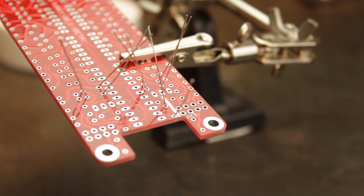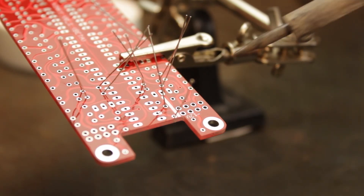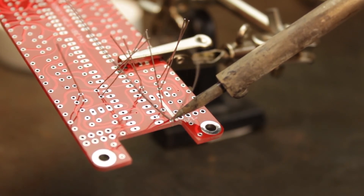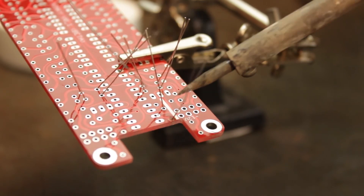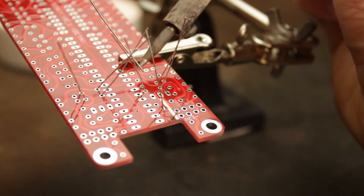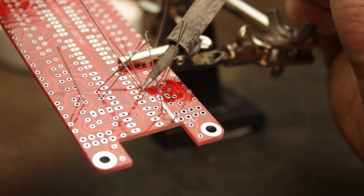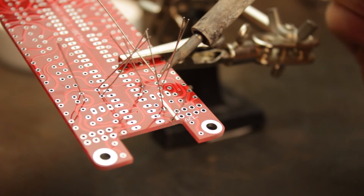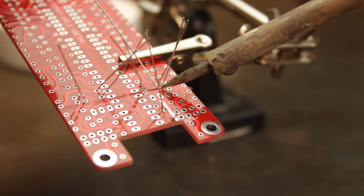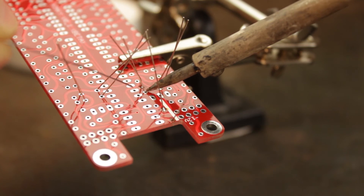In soldering it is important to make sure that we are transferring enough heat to both the metal pad and the leg of the component. First bring in the iron and place it on the surface of the metal solder pad, making sure it is touching the leg of the component. Bring the iron in at a steep angle relative to the board. Now that the iron is in place, do not move it until the job is finished. Next bring in the solder and push it at the point where the leg meets the solder pad. If the area is sufficiently warm the solder will melt and its surface tension will naturally draw it into the hole. Use as much solder as required — it's always easier to remove excess solder than to troubleshoot a poor solder joint later. Once you have enough solder, remove it and then remove the iron.